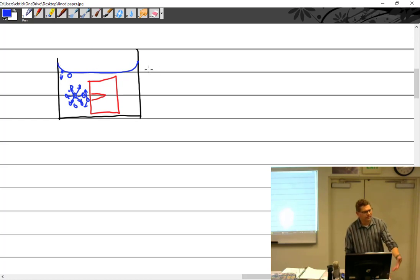So what that poorly worded way of what I'm trying to say is, when you pull it out of the tank and you let it drain, you get this effect here on the surface. Because if we look down here at the surface, the molecules aren't doing this down here, right? It's actually filling in all this. There's no pull up. You get the pull when you get near the surface when you have dissimilar molecules up here. So that's what's happening on the part. When you take the part out of the bath, you actually create this surface tension all over the entire part, which makes the penetrant want to run into the part. Hopefully that makes more sense.